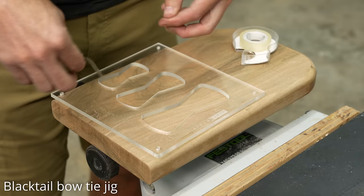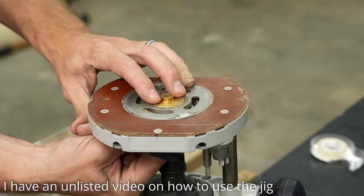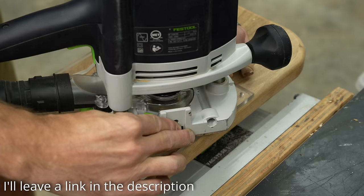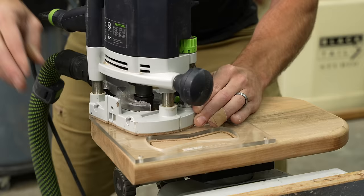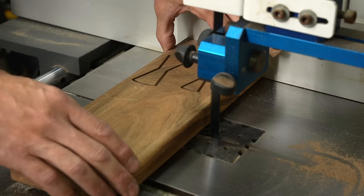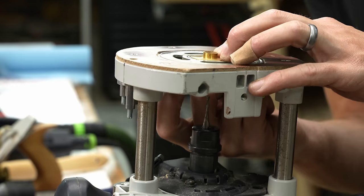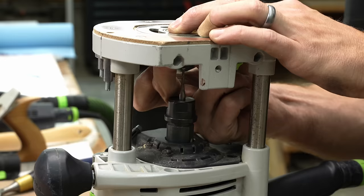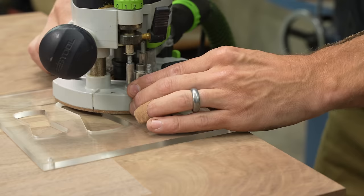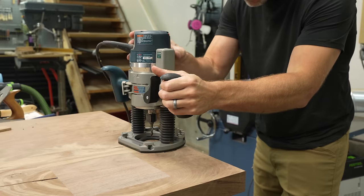This was far from the worst slab I've ever dealt with, but there were a fair number of defects to address. On the top side I'm going to try something I've wanted to try for years — something I think is going to be awesome, but something I think a lot of you are going to hate me for. First I wanted to address some cracks on the underside using my own bow tie jig. I didn't invent the idea of using a jig for bow ties, but I created this design because I absolutely hated every commercial bow tie jig out there. The nice thing about this bow tie jig is it's super fast and super accurate — you basically need zero skill, just a router, some bushings, and you can cut absolutely perfect bow ties.